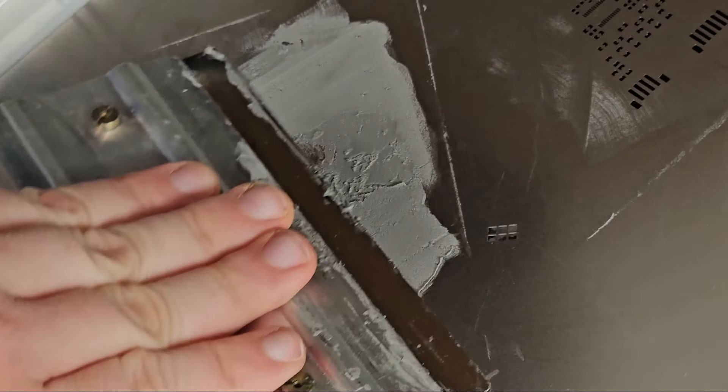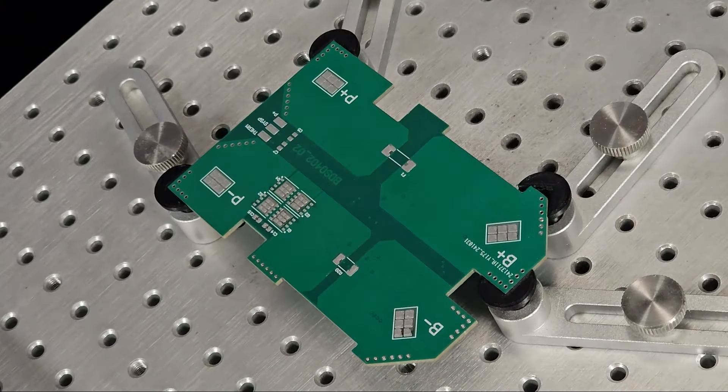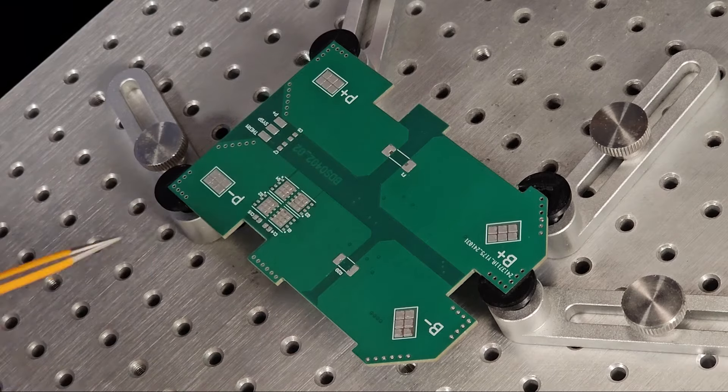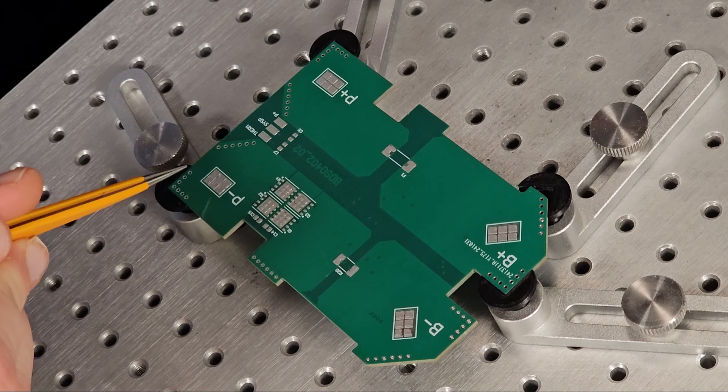So again we take our butter knife, grab some paste, and put all the happy little paste on there — just smear all that happy little paste. Then we're just going to take it and drag it across. I want you to know that even though it looks like I'm putting pressure on the PCB, I am not — I'm simply dragging this over by its own weight. This paste is a little bit stringy because it's a little bit old, but it reflowed just fine. If this was lead-free solder paste I would worry about it, but it's not — it's happy lead solder paste, the greatest thing to ever be invented. And there we go. So let's just lift it up and take a look — yes, all of our lands and everything are perfectly covered, even though the stencil cutout wasn't quite right. So let's take our components and tuck them into this happy little solder paste.